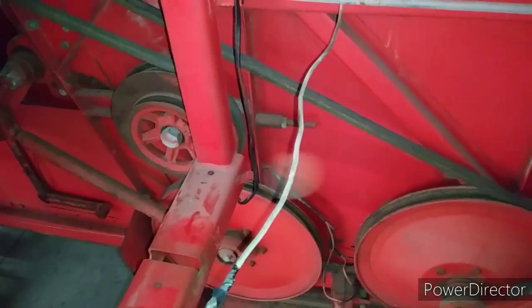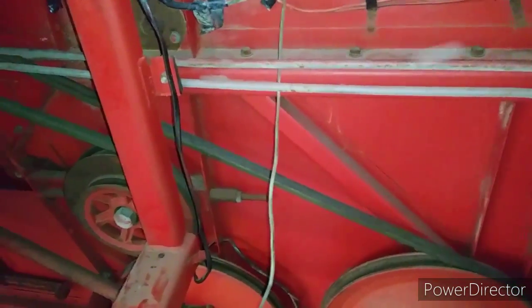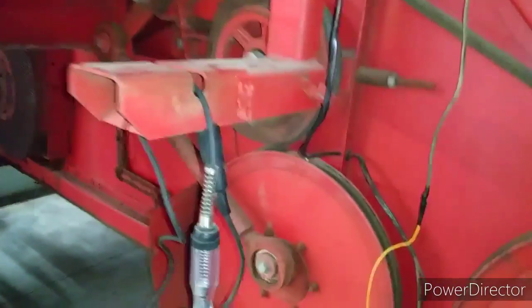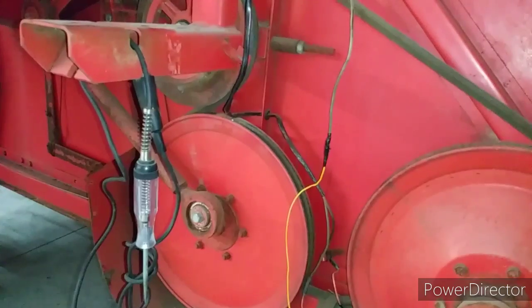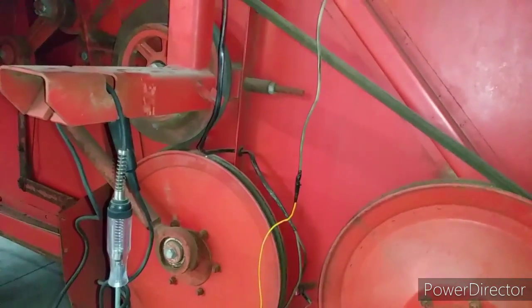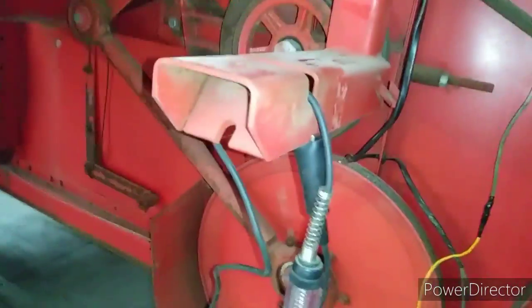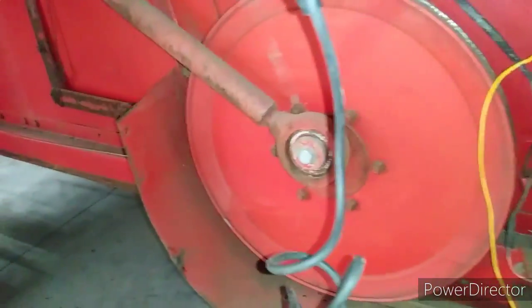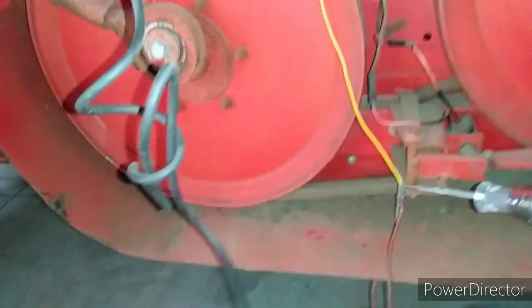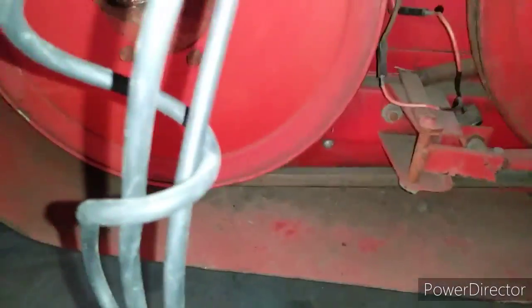Okay, with the fuel line removed, we now can turn our attention to see if we have power back here through the wiring harness for the fuel pump that we're going to install so that we can pump fuel up to the engine. What I have done is went and got the battery out of winter storage. I try to keep my batteries in a heated shop if I can. I have installed it up by the motor. I have turned the key on. Got my 12-volt test light here. Make sure I have a good ground right here. And this has been repaired 1 time, 2 times without any tape, and then this was on the pump down there. So, keeping that away from the frame.